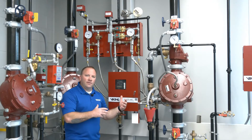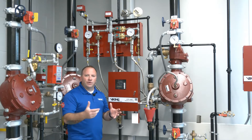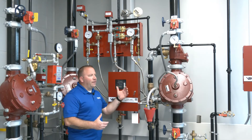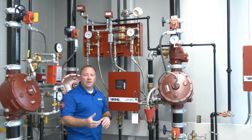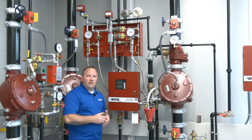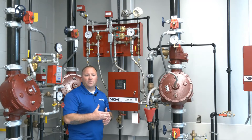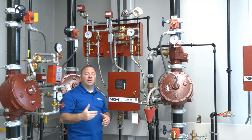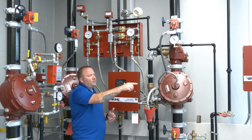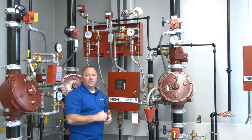What makes FireCycle 3 unique is what happens next. When the fire sprinkler discharges water and the temperature in the room begins to drop because the fire is controlled, the heat detector will automatically reset and the VFR 400 will pick up on that. The VFR 400 then initiates a soak timer — programmed into the unit and adjustable. Once the soak timer expires, power is released from the normally closed solenoid, returning it to its closed state. That allows prime water to back up into the prime chamber of the valve, closing the valve and shutting off water to the fire sprinkler system.